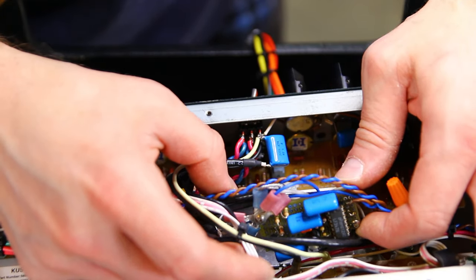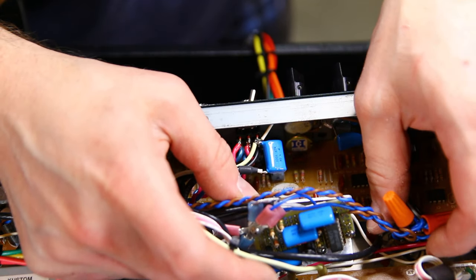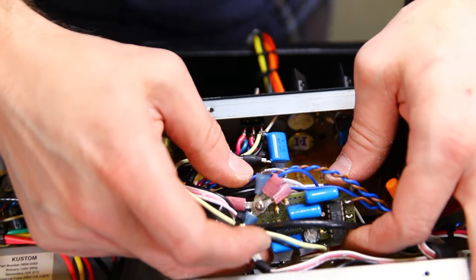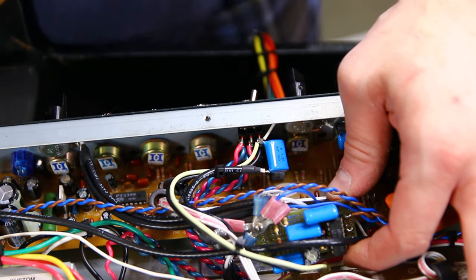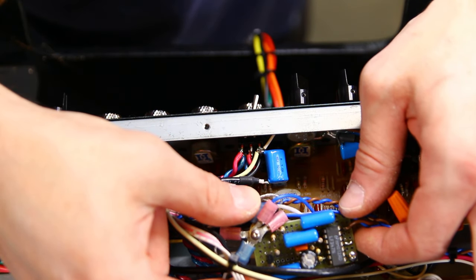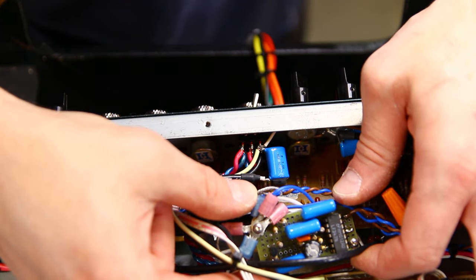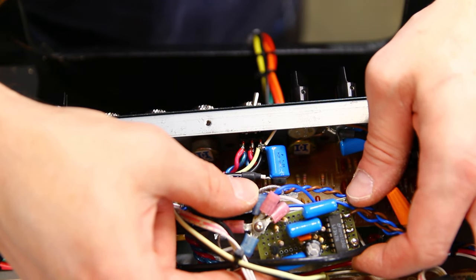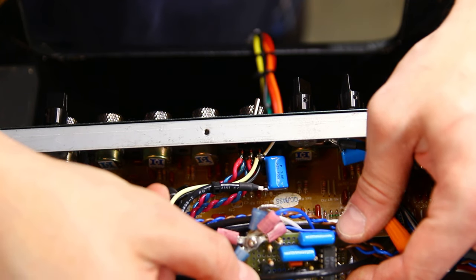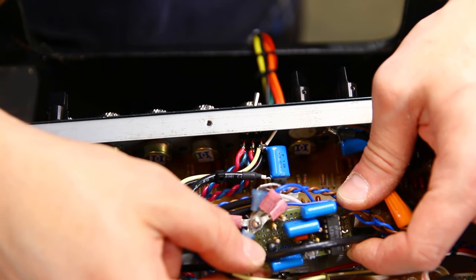Alright. So after a little dinner, I got some of these wires pulled apart a bit. It looks like, for the reverb driver, I'm using an LF347, which I think is a quad op amp, and also a transistor. Can't really tell. I have to look. It's probably an NPN, like a 2N3904 or something like that.